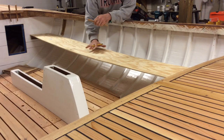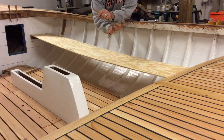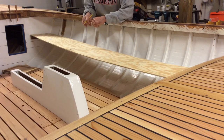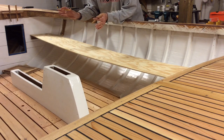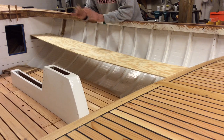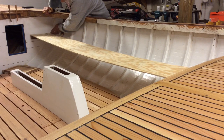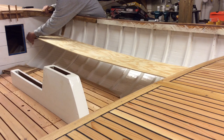I've got it in here now — it's 88 inches right on the nose. I measured it before and wanted 88 and three quarters, but it came down to 88 and 1/16th — 88 right on the nose. I don't know if everybody's boat would be that, but I think I was pretty close on setting up the frame. I cut a little curve out of here so that this would sit down in here and not rub up against the hull, and I'm just sticking out from the seat frame cleat maybe three quarters of an inch here.